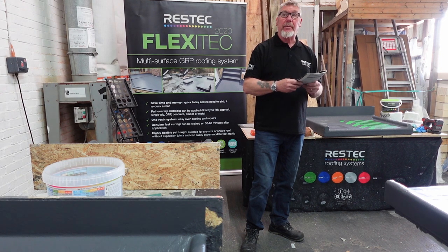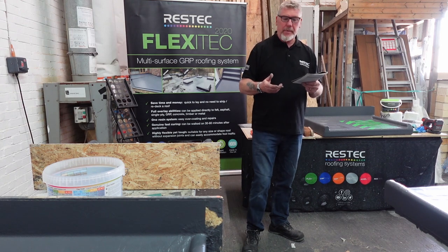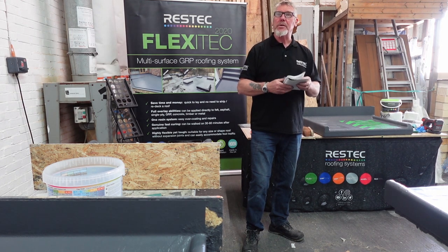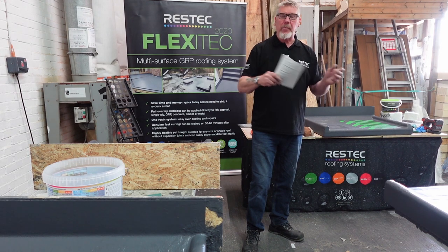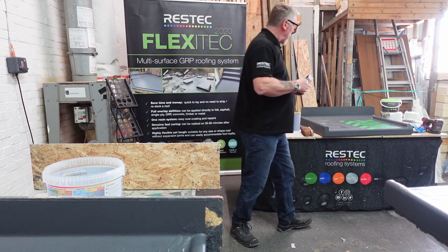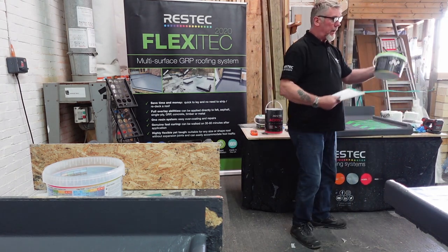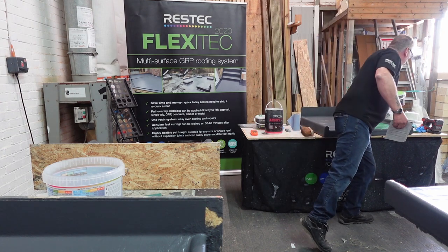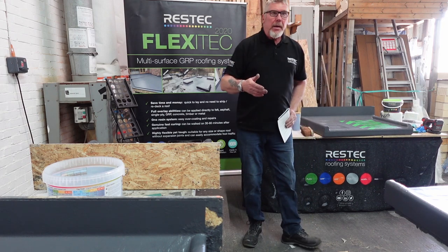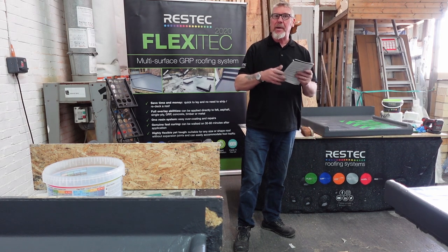Surface remains tacky after curing, yeah, you're probably not putting enough catalyst in with it. Think about what you're doing with it. Colour variation, now you will get colour variations if you buy lots of different batches. All our resin is put together in a batch, and every bit of resin we do has got a batch number on it, yeah? So when you're buying this, you'll try and buy the same batch, like buying wallpaper, yeah? If you buy wallpaper, it might be the same pattern, but the ink might be slightly different, so you might get a differential on that one.